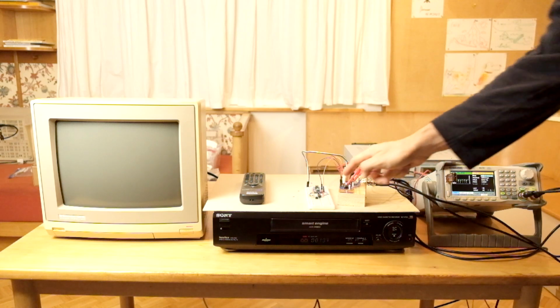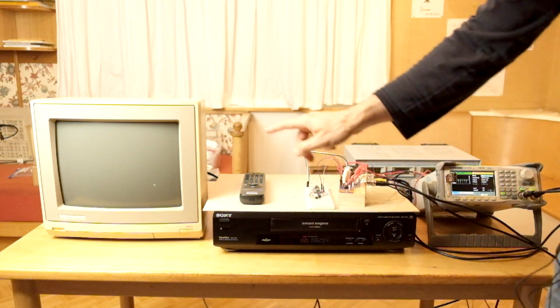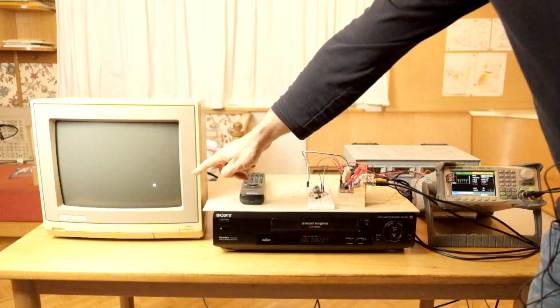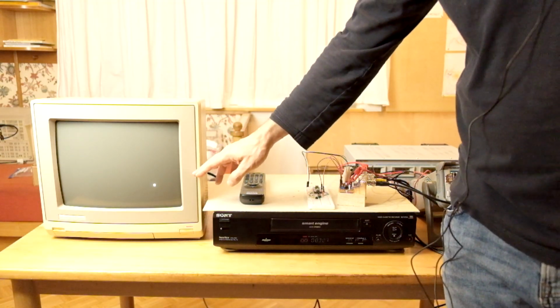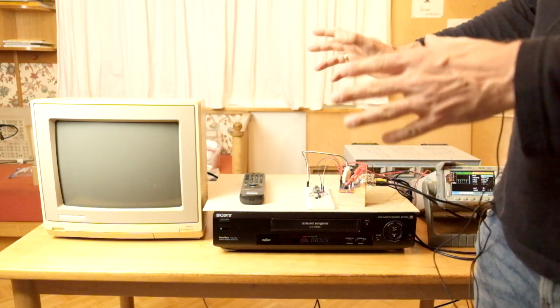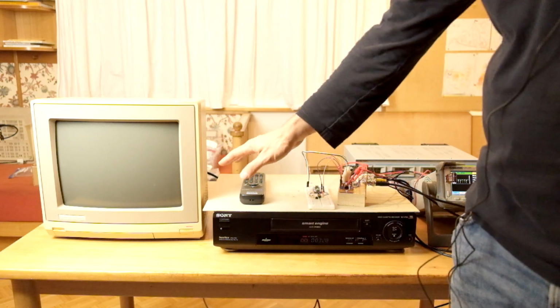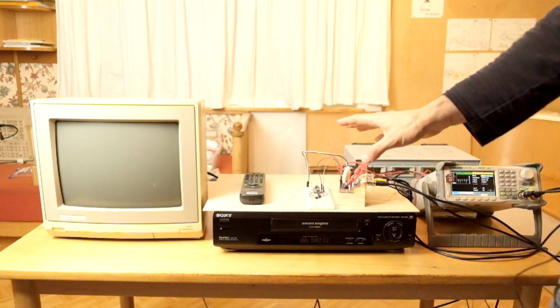Now let's turn the dot permanently on. So let's go. A few seconds of brightness and then you will see the actual data transmission. Here it goes, the magical blinking dot. The transmission should last for about 4 minutes. I timed the original transmission, and from that I calculated that probably the original used 3 stop bits per byte. So that's the same that I'm doing here on the Arduino Nano.